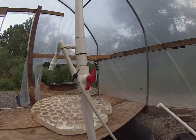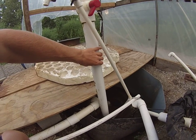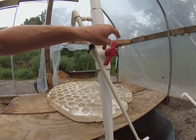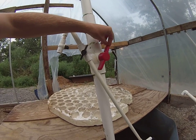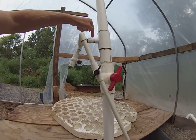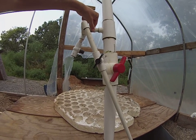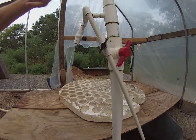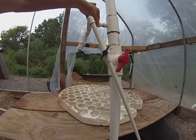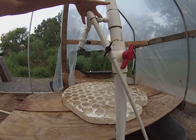We're going to start with the sump tank. We've got a 3,100-gallon pump into a two-inch line with a two-inch valve about 70–75% open. I have a relief point — this is an overbuilt system. I'm going to stress overbuilding your system: it's better to have more and not need it and control it, than to need it and not have it.